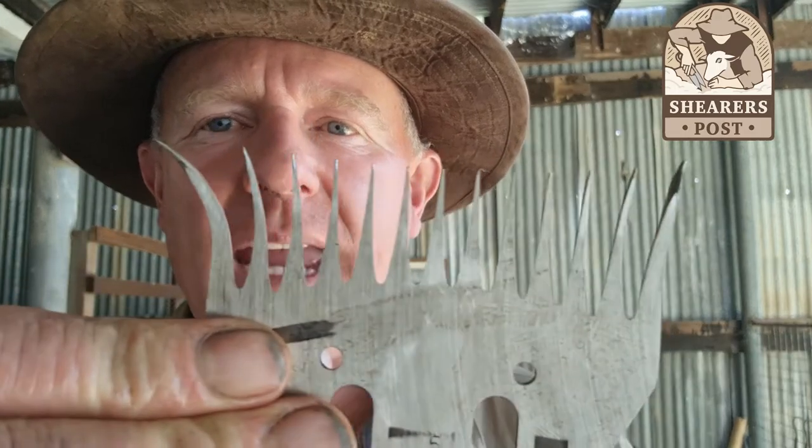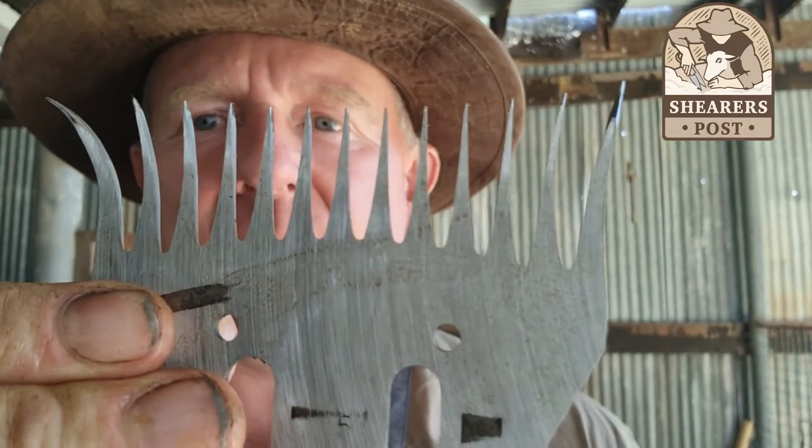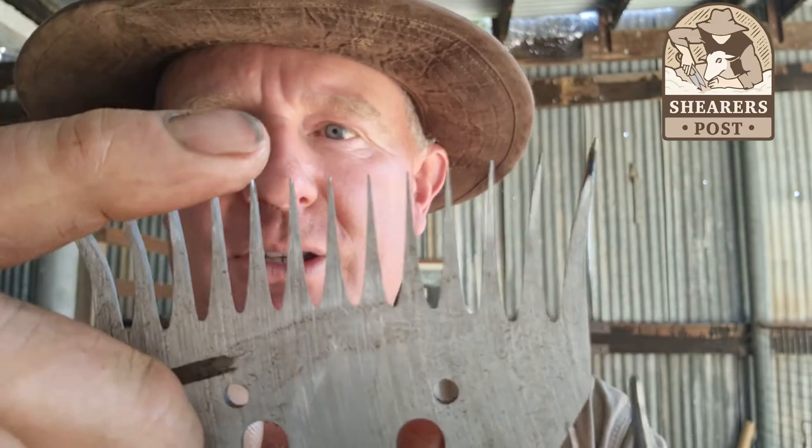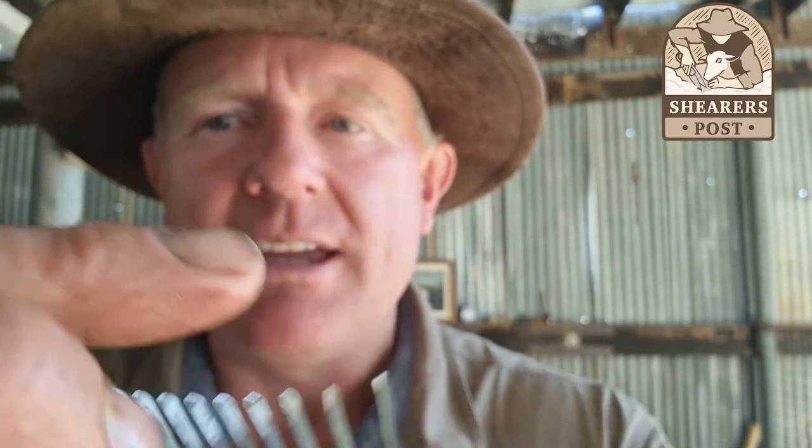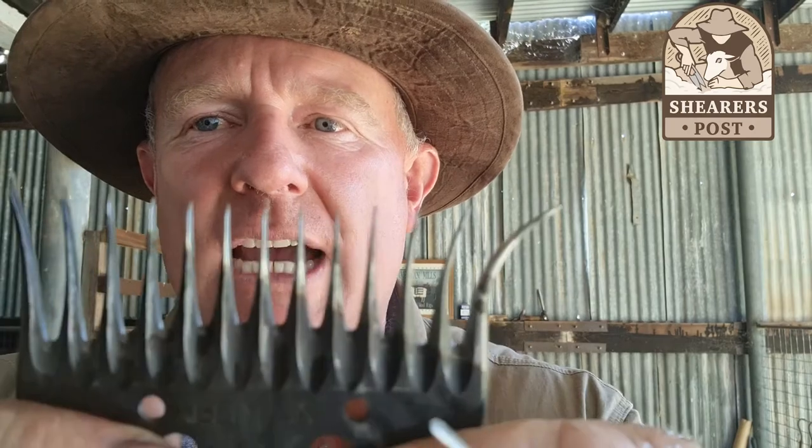You can use most any type of comb that would suit your sheep, but a thin comb is best. See how I've ground that one away as a flat surface and there's not much scallop left up the top. You can see a little bit of scallop still left on it, but not much. The teeth aren't what we call prickly, so they're still rounded over. If you feel the top of the comb, they're not sharp. That's ideal for crutching.